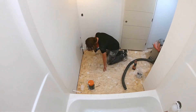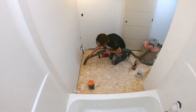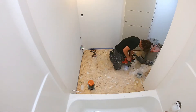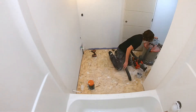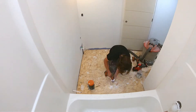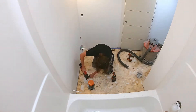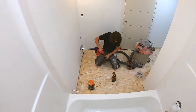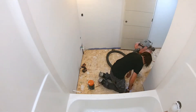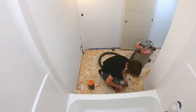I'm using a proper hammer drill — not the hammer drill mode that comes on a regular cordless drill, but a proper concrete hammer drill — and that does make the process go significantly faster. I'm also using a drill with a chamfer bit, which allows me to countersink all the fasteners into the subfloor panels so I've got a smooth surface on top. These Tapcon fasteners use a number three Phillips bit. I'd recommend grabbing a few extra bits at the hardware store — I went through one bit for every 25 fasteners or so, snapping the tops right off them.